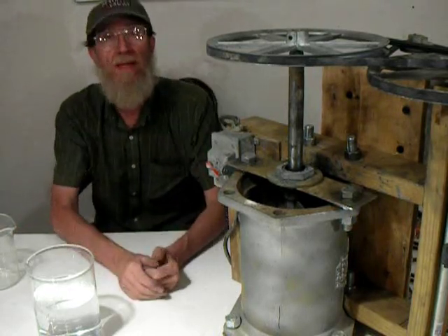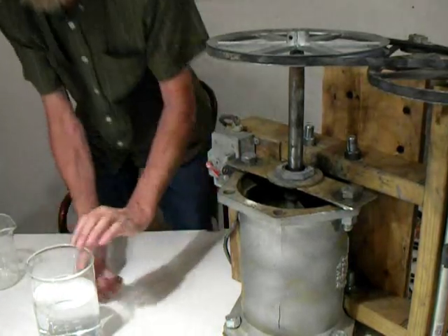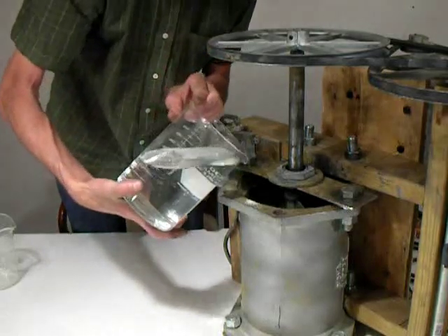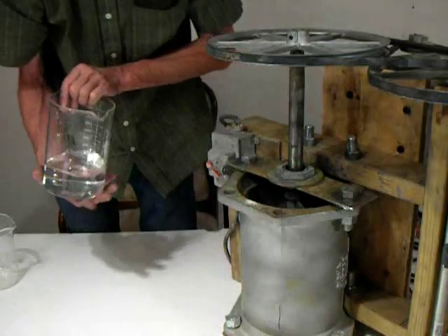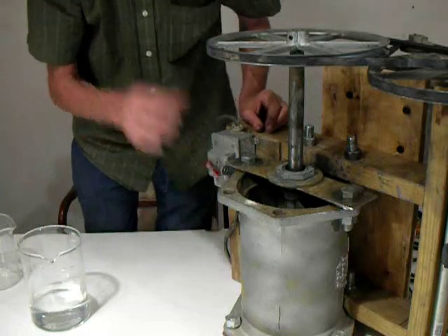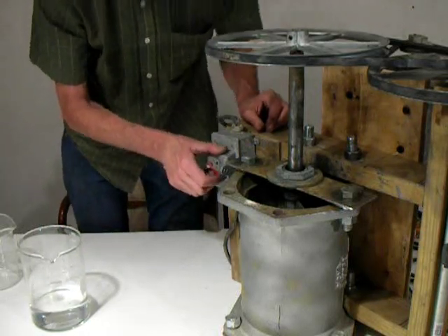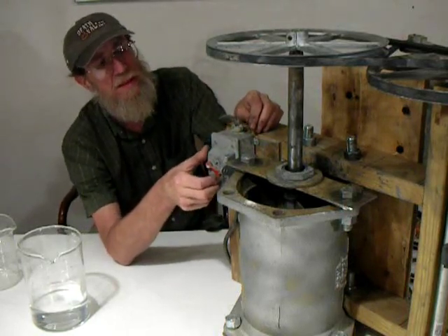See if I can get about a five gallon batch of this stuff in relatively short order. And of course the water — otherwise it will produce a lot of dust. It's going to be green sand anyway, and the water will help in the mixing. Bentonite clay has a remarkable ability to absorb a huge amount of water and expand — that's one of its interesting properties. You've probably heard of drilling mud — well, that is what drilling mud is made of: Bentonite clay.